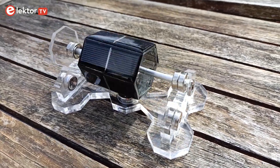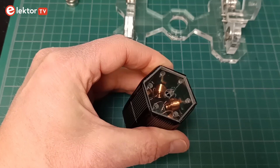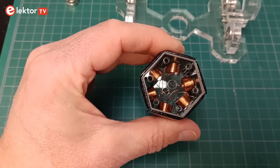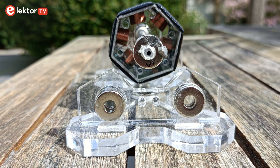In the case of this kit, the stator consists of a magnet placed under the rotor. The rotor is a shaft with six coils on it spaced 60 degrees apart. Each coil is powered by a solar cell placed at 60 degrees from the coil. The six solar cells together form a hexagonal barrel around the coils with the rotor shaft through the center. Note that the number of coils and solar panels doesn't have to be six, but it is for this kit.